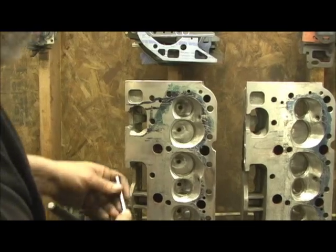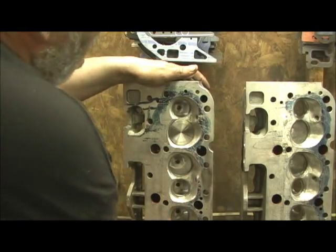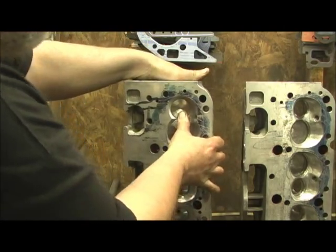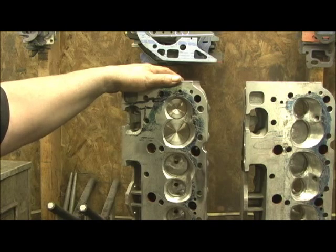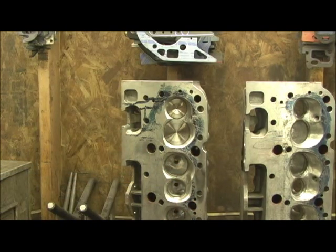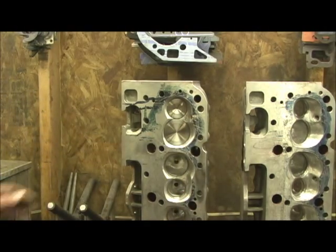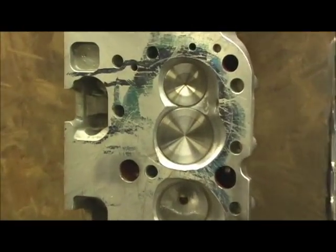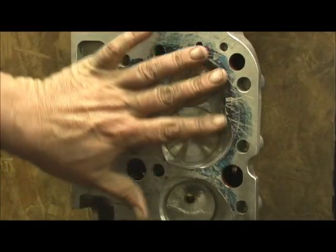It ain't much of an enlargement, and like I said, it's not about valve size. It's all about correcting that bowl and what Pro Comp done with the heads. As you can see, that's about as much as you want to take out of it safely because of the way that they put the seats in the head. But this is going to allow me to straighten up a problem, which when I do the valve job I'm going to show you what I come up with. Hopefully I don't have to go back and retouch these chambers again, but more than likely I will because somewhere on here it's going to leave a machinist edge on it. I just don't like to send my heads out like that — when you take your hands on a head, you're going to be able to run your fingers through every bit of it and not catch any ridge.